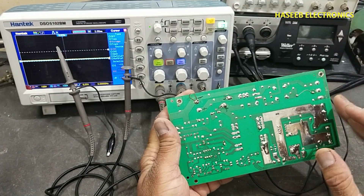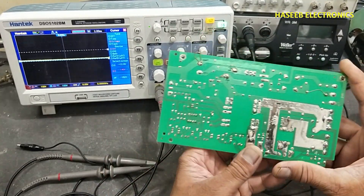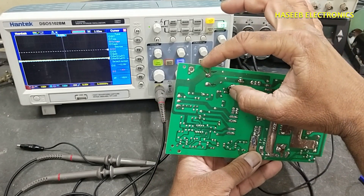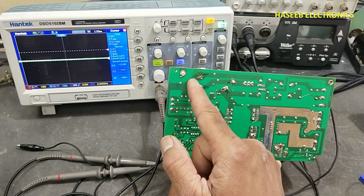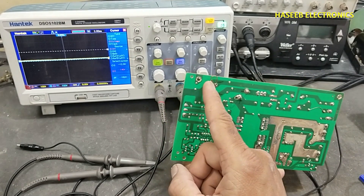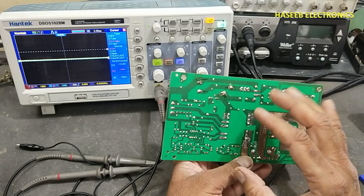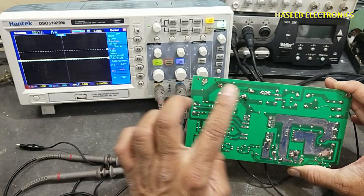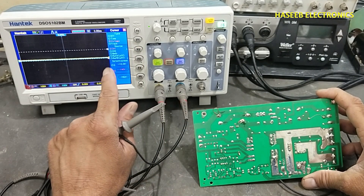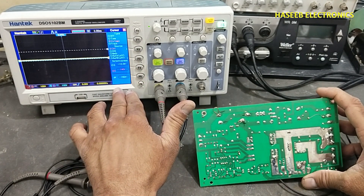It may damage our oscilloscope or it will damage the circuit. There are different conditions to measure these signals. Now I will test this signal from this unisolated circuit — it is directly connected to line voltage. If you don't have good practical experience in power electronics, never do this experiment or use an oscilloscope this way. We can use a battery-powered oscilloscope to test unisolated signals, or use an isolation transformer to power up the oscilloscope, or use a two-pin plug to power up the oscilloscope without a safety ground.